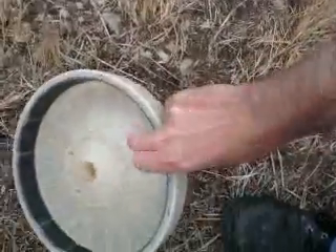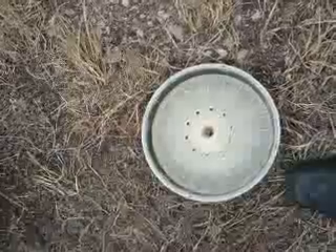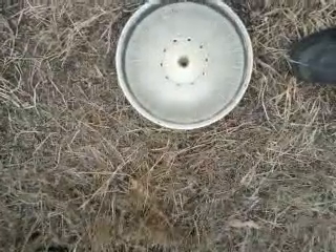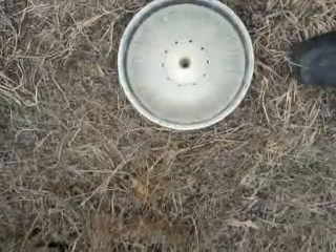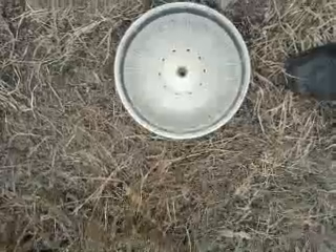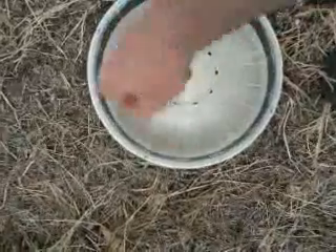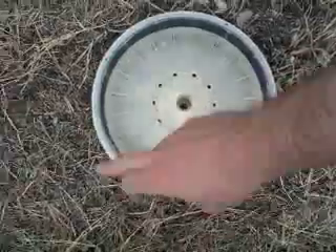That's all your magnets. Now this one is a 2003 build, 60 series. You will not find '60 series' written on the back or anything like that - it's a nickname used by people who make windmills out of these. 60 series means it uses 0.6mm wire in the windings. There's 80 series which is 0.8mm wire, and 100 series which is 1mm wire, but they're rather rare. This one has 14 magnets and each one of these blocks is supposed to be like four magnets on its own.